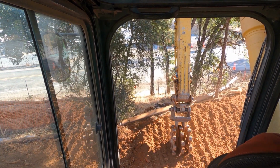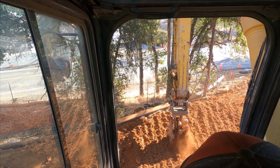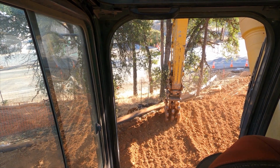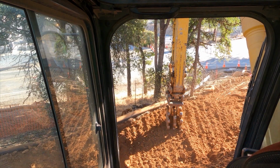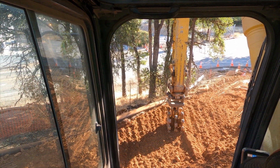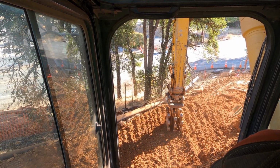As you can see, I'm just moving over little bits at a time, hitting the high spots and not just bashing in between where I've already been. This makes it so I only do maybe 3 passes, and I'm close to a 90 to 95. If I need to definitely get a 95, I'll make a 4th, maybe a 5th pass, depending on the material type.